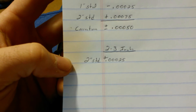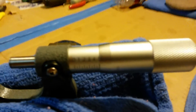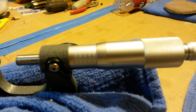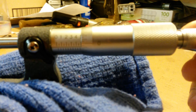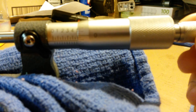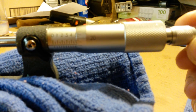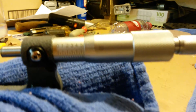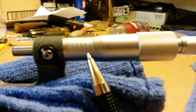For the two to three inch, using just the two inch standard, I'm eyeballing it twenty-five thousandths off. What I mean by eyeballing is — I don't know if you'll be able to read it — the numbers are your hundredths. So right now with this at zero, I'm at five hundred thousandths or half an inch. The half thousandths mark is the small mark. The barrel has twenty-five marks on it, so it'll open twenty-five thousandths, then another twenty-five and you'll get your half mark. In between the four and the five is four hundred fifty thousandths.